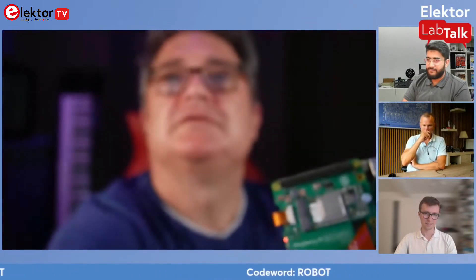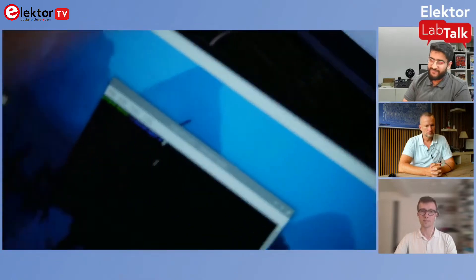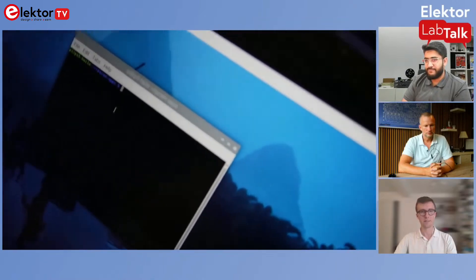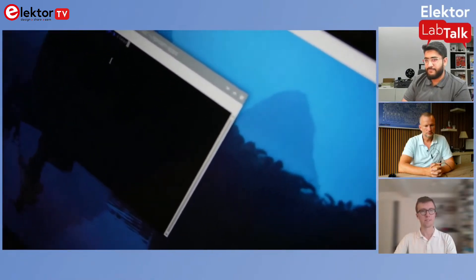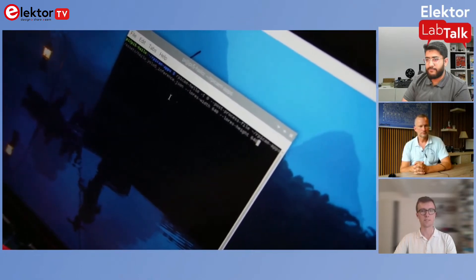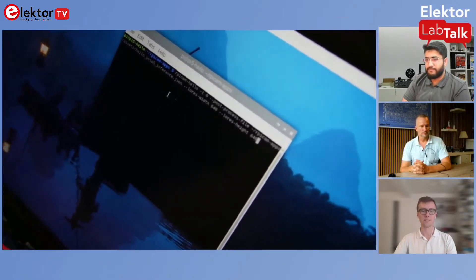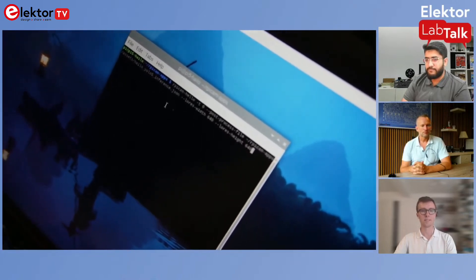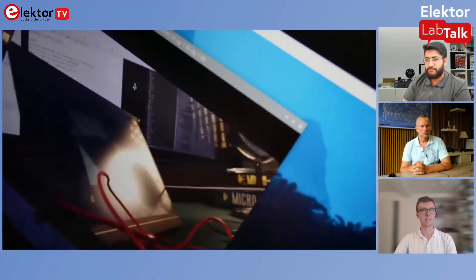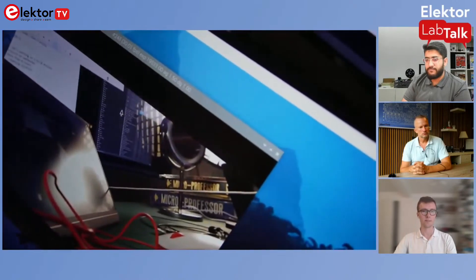It's running, it's connected, I've got a camera up and running, and it's actually running object detection on screen. The last command I used — I used OpenCV last time I experimented, but YOLO was suggested as better and it does seem to be the default for the Hailo kit. This one is using the YOLO5 inference model, and you can see the detection up and running — that is what the camera is seeing now.